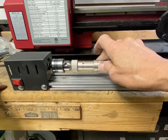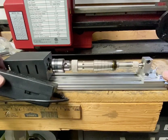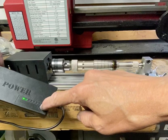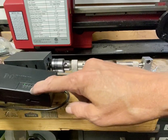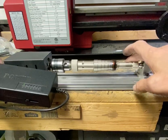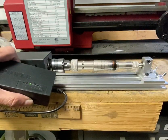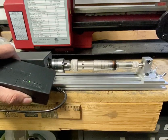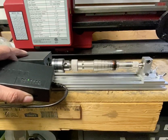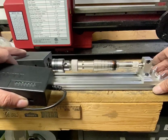You definitely want this to spin. If everything you do causes it to stop, look at the little power pack that came with the micro lathe — there are adjustments you can make to the voltage. Mine came on 12 volts, and I'd guess they all do. You can go up to 15, 16, 18, 19, 20, and 24 volts. If everything is slowing down too much or stopping, switch up the voltage one or two steps — that's usually enough. Beyond that it starts to feel a little unstable, so take it up enough to complete the work but not so much that everything is rattling around tremendously.